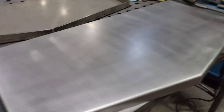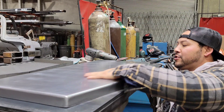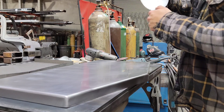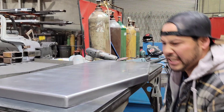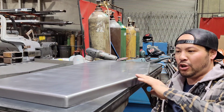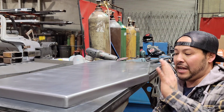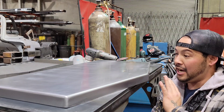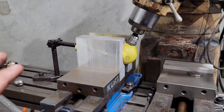Base stand number two done. I definitely had to break it down a lot more than I normally would, but this thing is so smooth now — like it's ridiculous. I actually broke it all the way down. I believe it was like 200 grit on the last paper, and then I hit it by hand at the very end. It is smooth. We don't have to go through this whole process normally, but because I had that little gouge in there, I wanted to make sure it was all nice and flat and level, so that when this is ready to go out to polish or chrome, the polisher doesn't hate our customer for bringing this thing in. It's pretty much a pre-polish at this point.